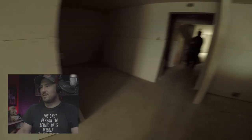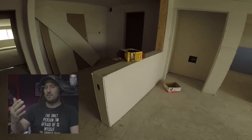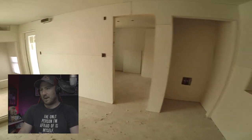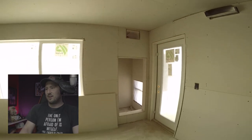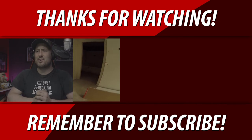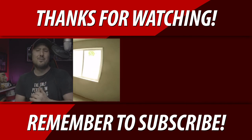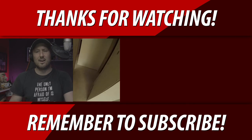There's a joint there in the closet and a joint by the doorway as well. If it's under 48 inches in a doorway, you can do a stand-up and get rid of that butt joint instead of doing lay-downs. Overall, not too bad. You can see in the P-stack area there are two joints where we don't have any of those joints in ours. Thanks for watching, guys — remember to subscribe and hit that bell notification icon so you don't miss when I go live. No eyeball drywall. Love you guys, bye.